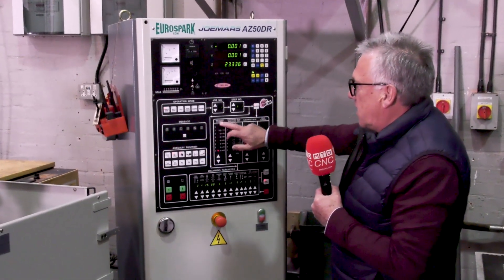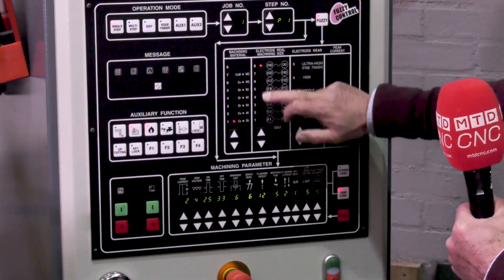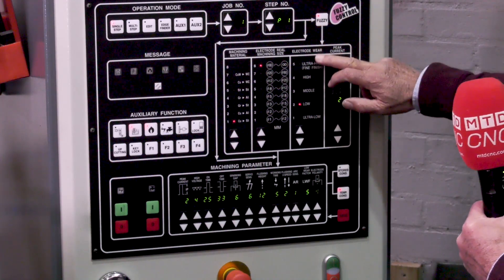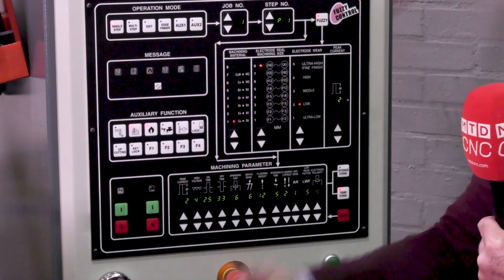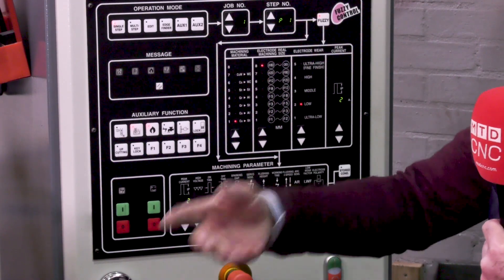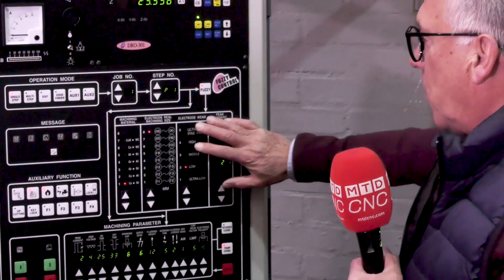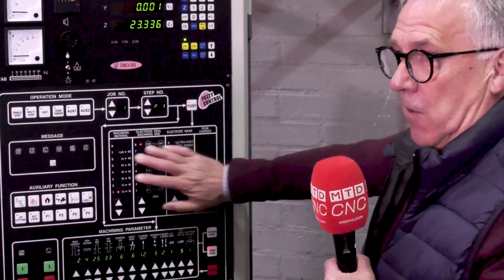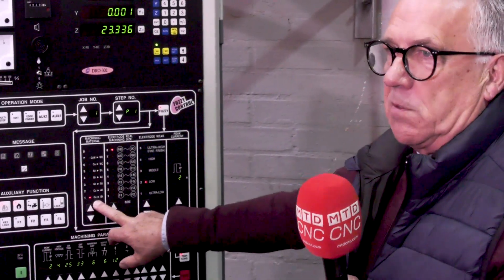What we've got here are the different electrode materials, the surface areas you can use, and the refinements of whether you want a rapid cut, a slow cut, a really fine finish cut, or an average cut which is acceptable time-wise and surface finish-wise, depending on application. So what we have here is a combination of all those things that the operator can use. Nine times out of ten you're sparking copper into steel or graphite into steel, so you use these arrows to get to where you want on the material.